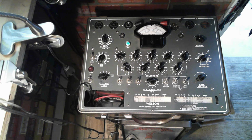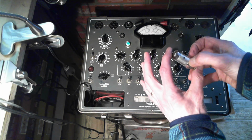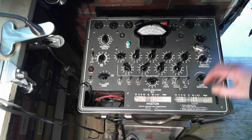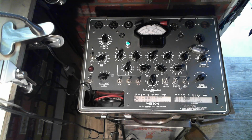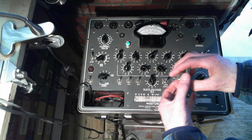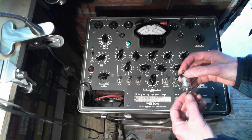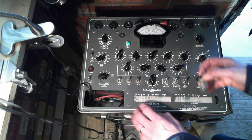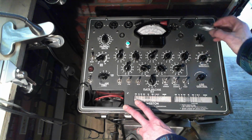Okay, next tube is the IF amplifier tube. This is a very important tube. Of course, they're all important. You can't run the radio without it. EF89. I can see enough of it to know it's an EF89. Okay, gotta find the settings for an EF89. It's always interesting to read about these tubes and various substitutes that can be made, and in some cases some substitutes require a rewiring of the base wiring. But there is a direct one that's talked about, 6DA6, I remember that from the last radio I was working on. And on my tube tester it has 6DA6/EF89. That's pretty darn reassuring.